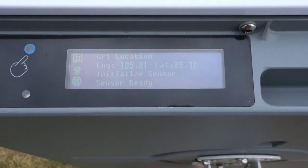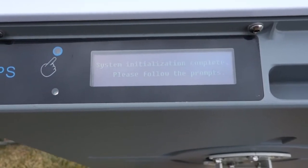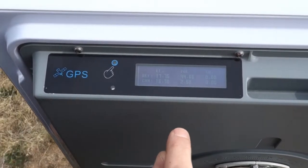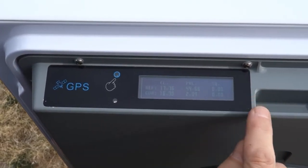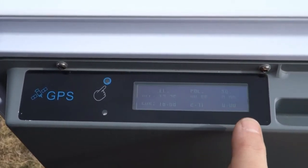You'll see it's fired up the GPS now and we're going to go into the satellite acquisition process. We're now in the antenna pointing screen, and you can see on the display what it's telling you: across the top is the reference — that's the target headings — and across the bottom is your current. Basically, you want to make the numbers match.